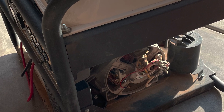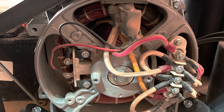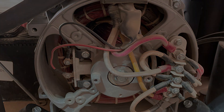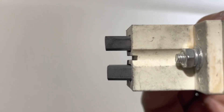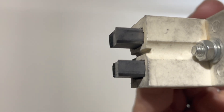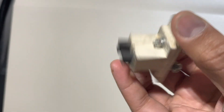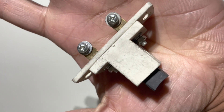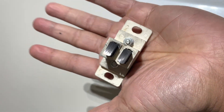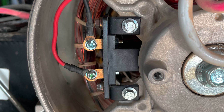Once you remove the cover, you will find the leads out of your stator, your brushes, and your voltage regulator, depending on the size of your generator. For this particular generator, once I pulled out the carbon brushes for inspection, I noticed they were not even. You want your brushes to be fully seated, not burnt, not cracked, and not too short.